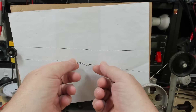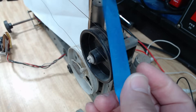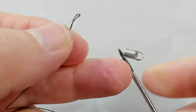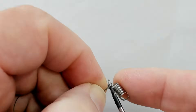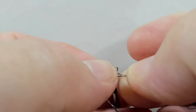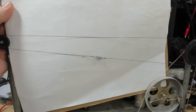Another thing to tackle is the dial string — it's very loose and I think the spring has stretched. I've got a spare spring, so I'll cut it and make a new loop. I put some tape on the string to hold it while I work, then removed it from the end pulley, shortened the spring, and made a new loop. Threading the fine wire through the spring and stretching it over the pulley — it's a bit tighter now and working well, though the string does look a bit like grandma's washing line.